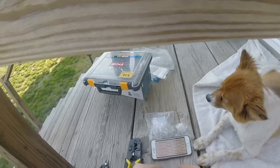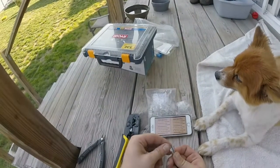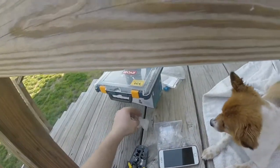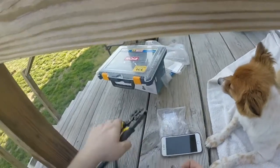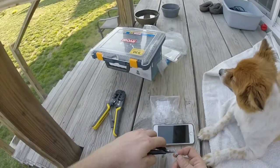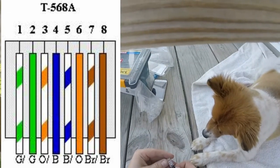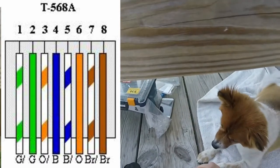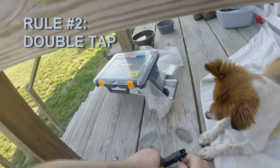Now that I had the end of my cat 6 cable outside I needed to crimp an RJ45 connector onto it to connect it to the camera. I use these crimpers and I really like them. I also use these cat 6 RJ45 connectors with sleds that hold my wires in place while I stick them inside the connector. For the cable you can pretty much use any pinout as long as it's the same on each end. You're just patching the connection through from one end to the other, but it's always good to use the standard, so I use the T568A pinout: green-white, green, orange-white, blue, blue-white, orange, brown-white, and brown. And remember rule number two from Zombieland — always double tap.